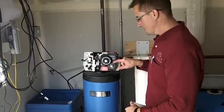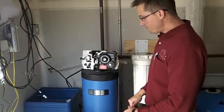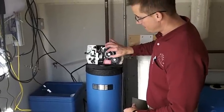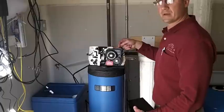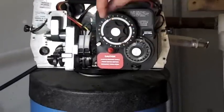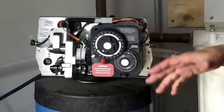In the event you go a little too far, there are pins on the back that push a micro switch down, and that's what starts a backwash. Sometimes the first time you do it, you go a little too far and nothing happens, because those pins fall off the micro switch. So in order to go home, there's a little raised dot — you go all the way around, you'll feel it fall into a slot, and it'll be lined up at the time of day. Then you can try it again and go slow to that first push to start a total cycle.